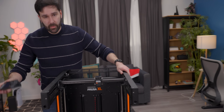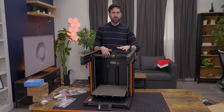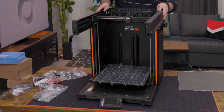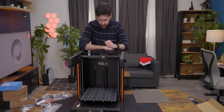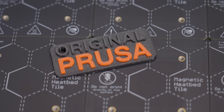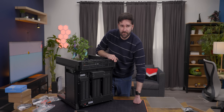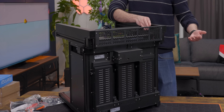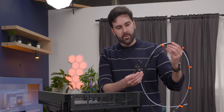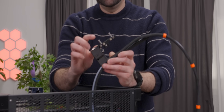This will pop into the carriage, and then these two locking tabs click in and hold the whole extruder assembly. We'll have five of them at the back, and then the whole head assembly will come there, release them, undock them, and move away to pick up the next one. Really neat system. Looks like we're going to have to install the LCD and control panel ourselves — that goes right about there, and it looks pretty much identical to the Mark IV. I believe this one does have chamber illumination. The XY plate here is a giant block of milled aluminum, which is awesome to see. The linear rails are also great. Still got some traditional 3D printed parts like the top Z-axis supports, but most of it seems to be really quite high quality aluminum. Looks like they've given us a test print in here. Turning it around to look at the back — I believe these have three separate power supplies. You're going to have five heaters plus the entire bed, so you're going to need quite a bit of power. Looks like we've got our standard aluminum extrusion channels making up most of the frame, with some nice blanking plates. And here's one of the mounts for the extruders — they're going to sit back here and feed your power, data, and filament through there.